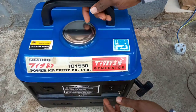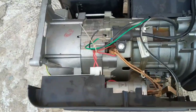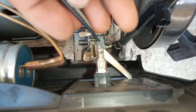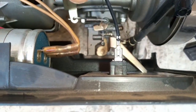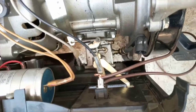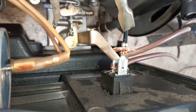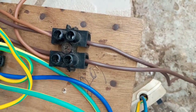This is the generator we are going to use. You see this is the on/off of the generator. We are going to open the generator — from inside, this is the start key, that is the start and stop of the generator. What you do is join two wires in parallel to this switch: one wire to this terminal and the other wire to the other terminal. One wire is connected to the first terminal, then the other wire is connected to the second terminal — that is in parallel to both of them. That is the wire connected from the off connector that will turn off the generator.